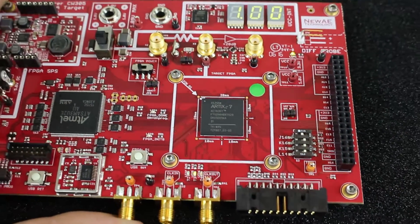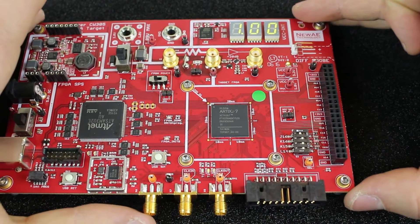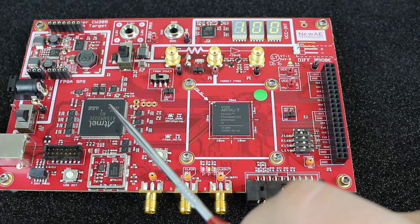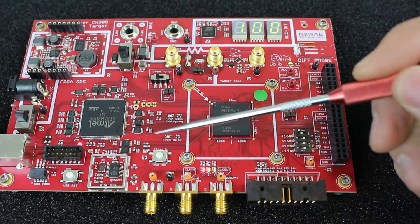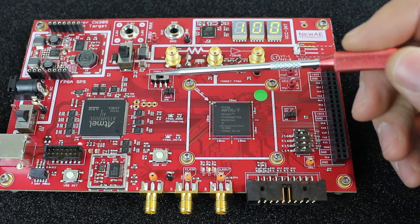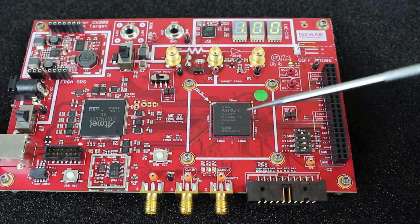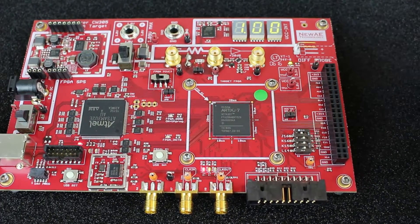Zooming out to show the whole board, you'll see there's a standard USB interface. This chip provides communication over an address/data bus — eight bits of data and a number of address lines. A lot of the examples will use 16 or 20 of those lines, as well as read and write strobe flags. This makes it really easy to implement memory-mapped registers that you just read and write over USB.